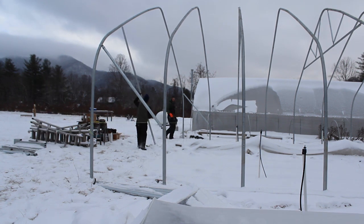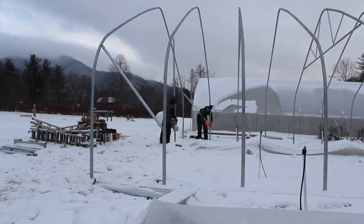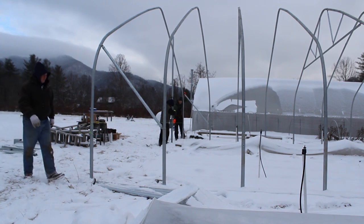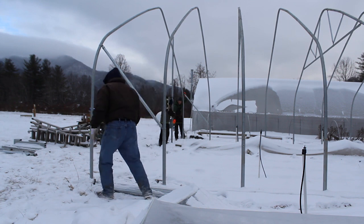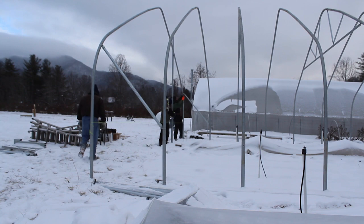Repeat this process on the other side. You could do this once at the peak only with a large straight member, but I feel like it's more precise if you do it on each side as shown here. So go ahead and plumb up on that other side, adjusting the brace band as needed and tightening down on that top brace band once you find plumb. This is what I'm going to do right here with my impact driver.